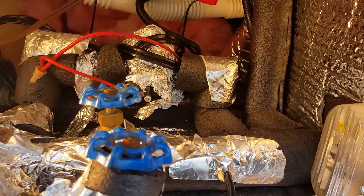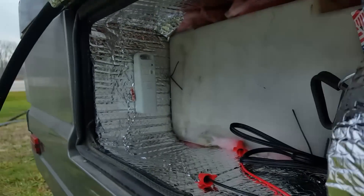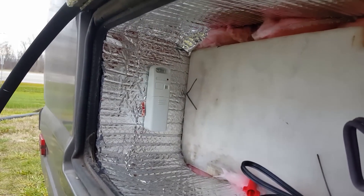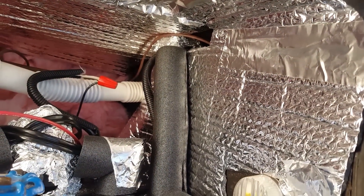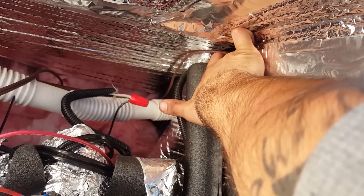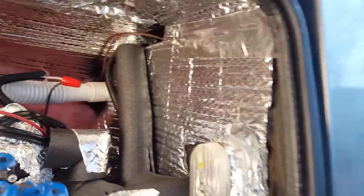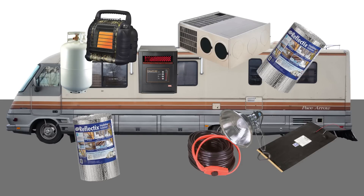Down and around into this baby. As you can see, we are fully insulated. That is where my water pump is and all this business. It is all heat taped, wrapped up, insulated. Heating pad. Big ass bulb. And back here on the other side of the bulb - I did that on purpose - that is my thermostat. The only area I have concerns with now is on the other side of this - we have a 90-degree elbow, so there's about a two-foot line of PVC pipe that is heat taped and insulated. Some of this heat can escape into here - I can already feel it's much colder over on this side. But that is my only area of weakness. And that's my gas tank right there. Believe it or not, that thing can go all night. So it will get me through the night. Then I got to start my engine and plug it in that way if it's below freezing.